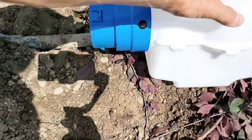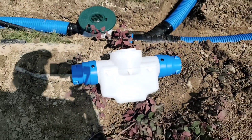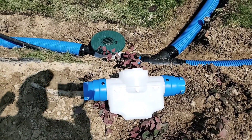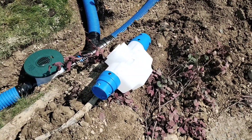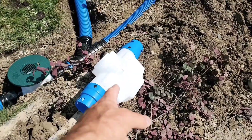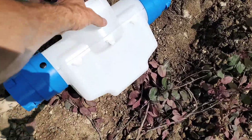This is our five to ten year sediment trap for shingle gravel. Shingles are the thing that load up and really clog a line — that and leaves. So between our leaf filter and our five to ten year sediment trap, every five years this needs to be cleaned out for shingle gravel. It'll hold five years' worth of shingle gravel.